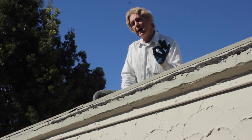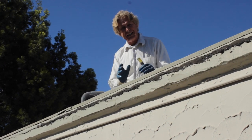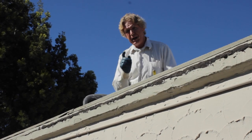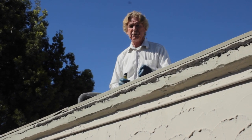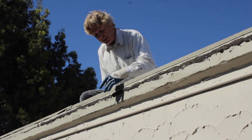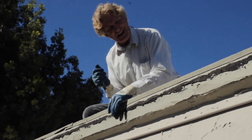Take Henry's roof and flashing — Henry's is a good product. I've used it a lot of times. If my roof is leaking and it's raining and I'm up there thinking I've got to fix this, Henry's will stick, especially if it has the fibers in it. You put it on, trowel it down, boom — you're fixed for a certain while. But what they did is they put Henry's here, and it's not really designed for this application.